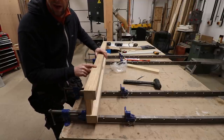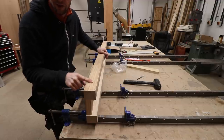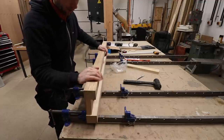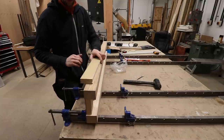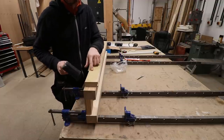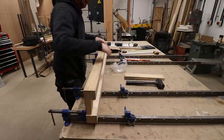If you're not going to be doing that and you're making it to complete size, if you're ever bashing the edge or anything like that, make sure you use a wooden block to protect it from dents. And if you catch the corner, you're going to knock the corner off. So you just want a protective piece like that. If you're ever hitting any wood, you can hit that, dent that, and it spreads the load through onto the part that you're trying to adjust.